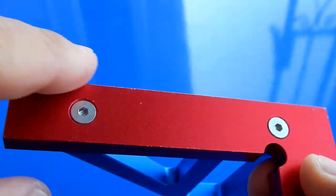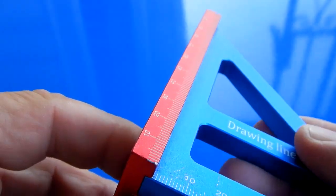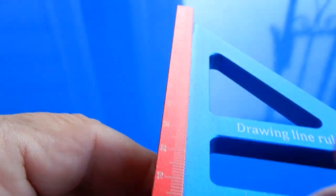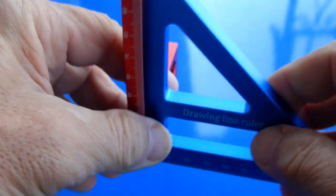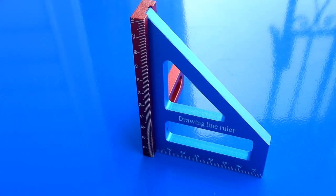This comes in two pieces. You get the Allen wrench and the two pieces, and you put them together — apparently you can use them separate should you choose, but I have no desire to use them separately. So here's what I did: I took a little bit of two-part epoxy, a very thin amount on a toothpick once I mixed it, and put it inside that groove. Then I screwed it together and took it on a granite plate, which I have. Granite plates are very precisely ground, flat, and parallel — a flat surface that machinists use for setups and measuring. That's what I did to ensure these two surfaces were perfectly level and that this wasn't lifted up.